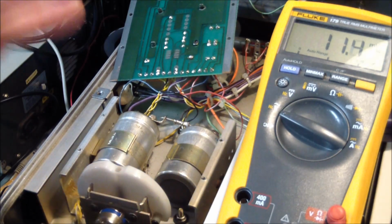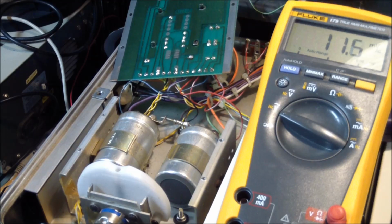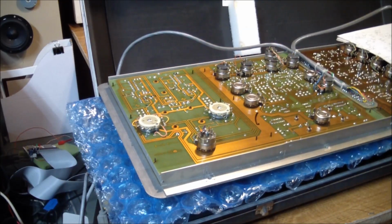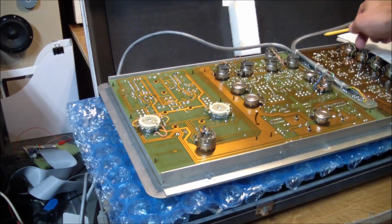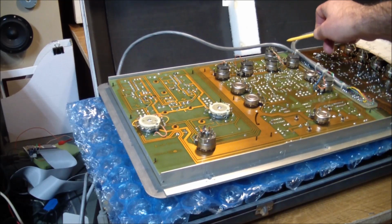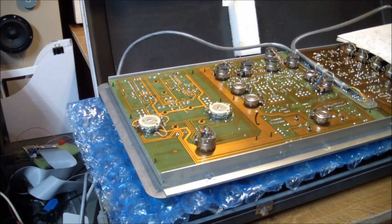Let's follow the voltage to the boards behind the panel, see if we can figure out if everything's going okay back there. So I loosened the control panel and laid it on top of the keyboard because it's got this big connector right in the middle here where we got the connection to the power supply, and it's going out to all the jacks that are accessible from the front, and the accessory jack and all of that. And I figured, let's see if the voltage is coming in.